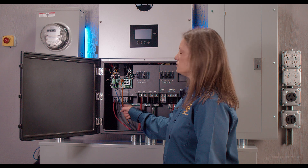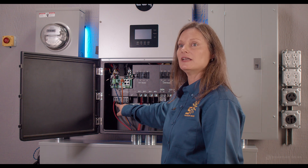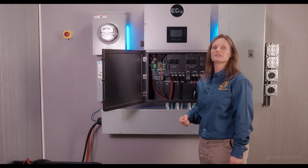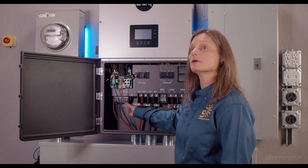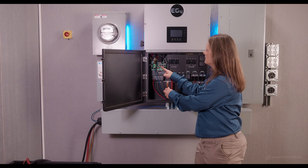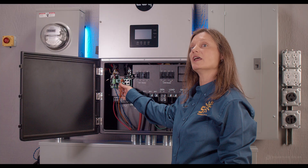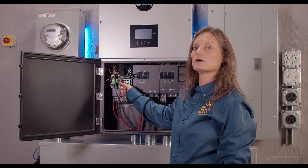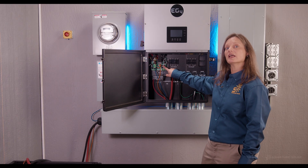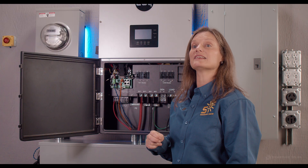Your PV inputs are found on the left — this is your charge controller with four inputs. MPPT number one allows PV strings one and two to be connected in parallel, eliminating the need for an external combiner box. These strings must be an exact match to each other and can carry up to 25 amps. MPPT two and three can be separate PV strings rated for up to 15 amps each. All MPPTs have a max open circuit voltage of 600 volts. The RJ45 cable connector plugs into the communications port, and this unit can communicate using RS485 or CAN protocols for closed-loop communication. The current transformers must be connected for grid interaction — make sure the arrow on the CTs points away from the grid and towards the inverter, and match L1 and L2 labels to the correct phase.